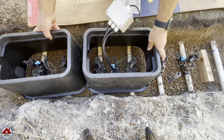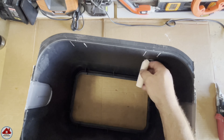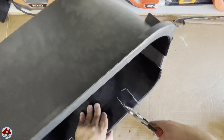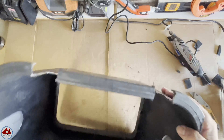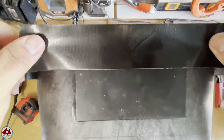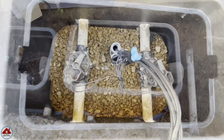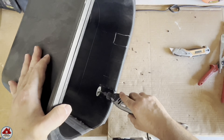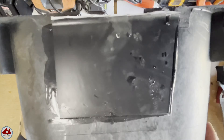Okay, finally let's get the valve boxes installed. I place them back into position and need to mark where to cut the pipe slots to allow the water pipes to pass through — I use a piece of chalk to do this. I take a measurement on how deep I need to cut the pipe slots and transfer that measurement, drawing out my new pipe slot cut-out. At first I tried cutting this thick plastic with my snips but it wasn't easy and took way too much effort, so I bust out my Dremel and it was much easier. Once I make my three cuts I use my pliers to remove the piece. I continue cutting out the rest of the pipe slots on this first box, then add duct tape over the vinyl wall base I used to close up the original pipe slots — I want to make sure they don't come off allowing dirt inside the box. I like how it came out. Let's do the other two valve boxes the same way — you have to do it one at a time so the boxes are in their exact position or the pipe slot cutouts won't line up correctly. This got easier and easier the more I cut.